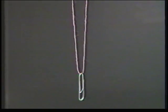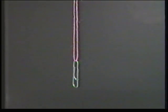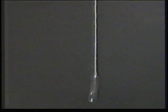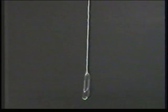Most single yarns are produced with Z-twist. It is common practice to twist two such yarns together to produce a two-fold yarn. This gives a more uniform and stronger product than an equivalent singles yarn. Also, good stability of twist is achieved, and the yarn does not attempt to untwist. A singles yarn will always try to untwist, and this can cause distortions in the knitted fabric.